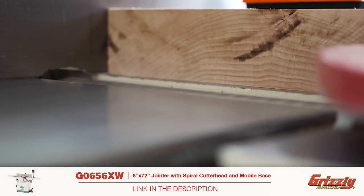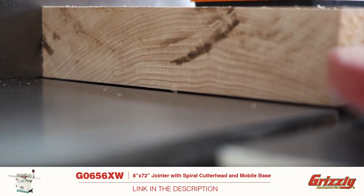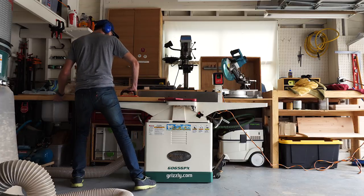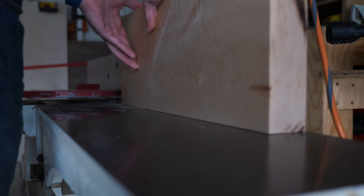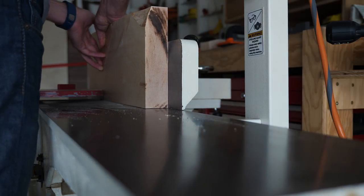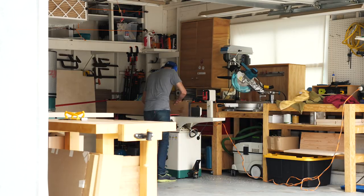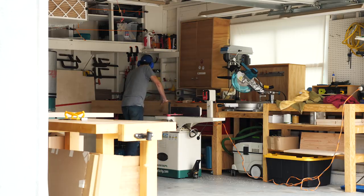The top is made out of 8-quarter maple, which is just shy of 2 inches thick. The finished piece is going to be closer to about an inch and a half thick, so there's plenty of room for fine-tuning the wood to get it nice and flat. Once each piece had a face that was good and flat, I turned them on their edges and took a couple more passes to get one of the edges flat. By the time that's finished, you're left with one good face and one good edge that are nice and flat and form a perfect 90 degrees.